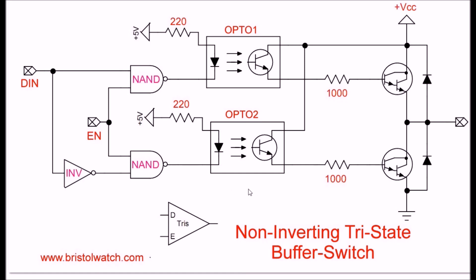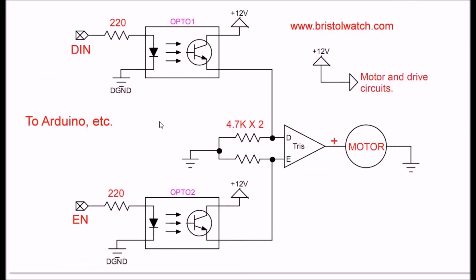Here's one circuit we will be looking at. In this case I've used a couple of optocouplers to isolate two NPN bipolar transistors, and depending on the voltage rating of the optocouplers and the transistors, I could run this thing up to 58 volts. It isolates me from the 5 volt digital logic. We can also use optocouplers on the tristate inputs to completely isolate all the motor voltages including power supplies away from my microcontroller.